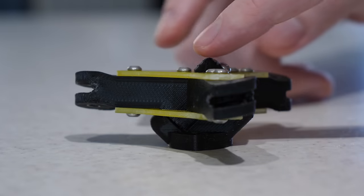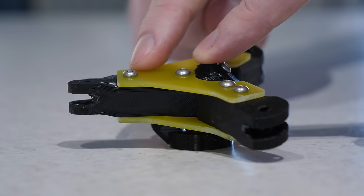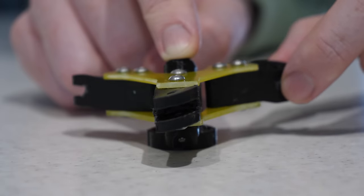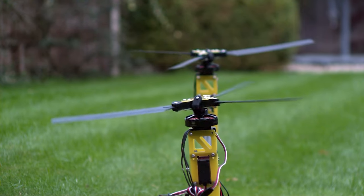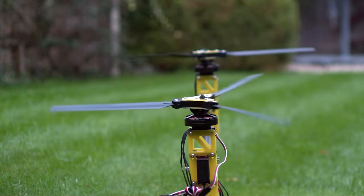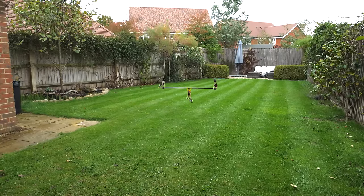So with this information, I have to build my own. This rotor head has a central hinge at a 45-degree angle, which means when the motor accelerates or decelerates, the blade in line with the hinge will change in angle of attack, but the other two blades will actually move up or down. This looks a little odd when rotating, as one blade maintains the same plane of rotation but the other two seem to follow a different plane. Once on the aircraft, it was clear that the previous vibrations were gone, which was very promising.